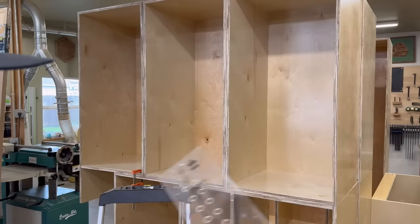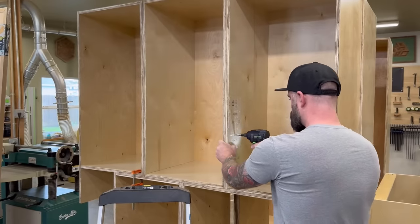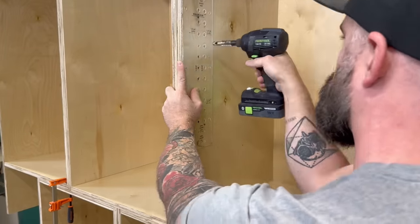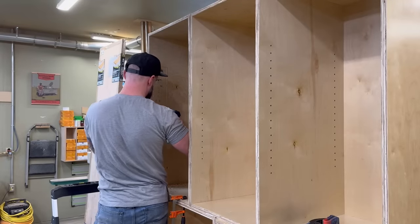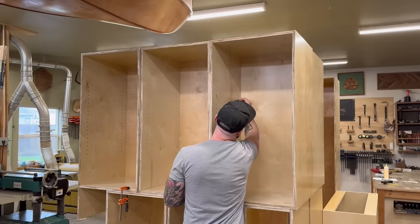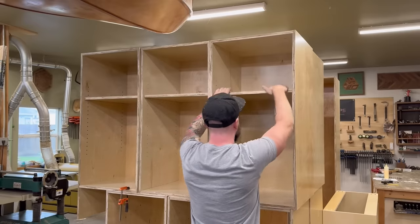For the lower shelves I'll be using two sheets of half-inch plywood per shelf — one on top and one on the bottom — to create a secret sandwich. I normally mount shelves using shelf pins and a jig like this one from Rockler with a special drill bit — zip, zap, soup — you drill perfectly lined-up holes, add pins, and mount your shelves. I drilled holes all the way down because this is secret storage and I want everyone to think nothing's going on. If I'd stopped the shelf pins at the top it would've been pretty obvious something was different on the bottom.